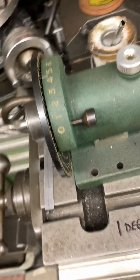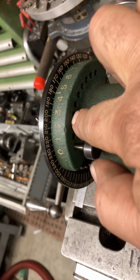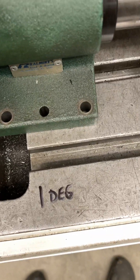As long as you kind of go easy with them. As you can see, there are these locking holes here and we have 10-degree increments. But here's your bonus — there's this other scale where you have one-degree increments, so these things will go 360 degrees in one-degree increments.